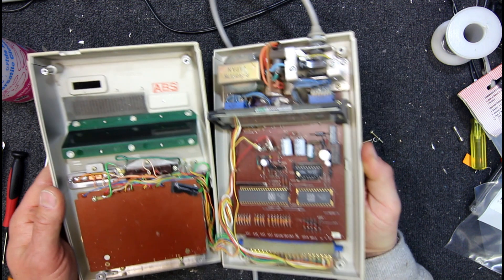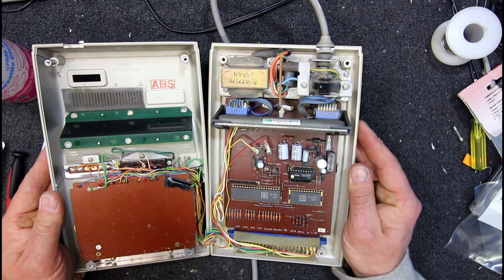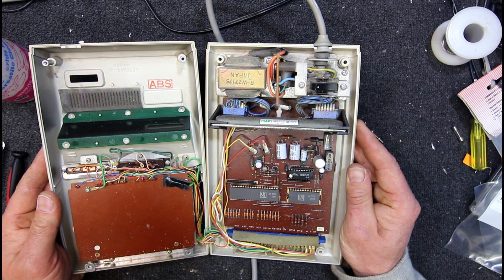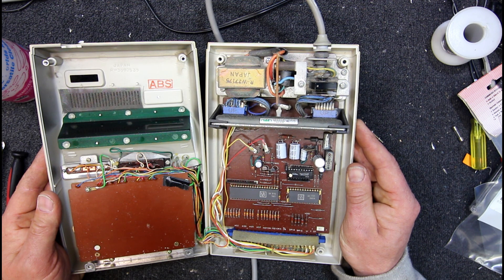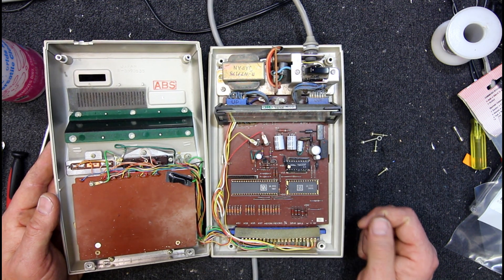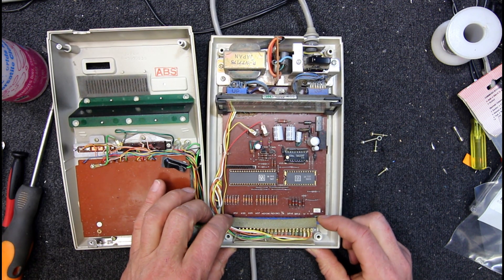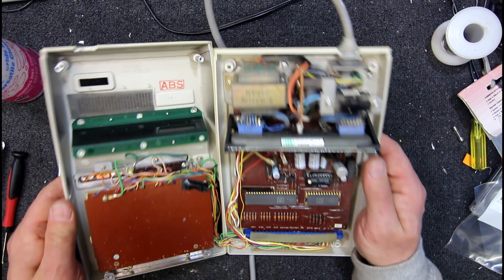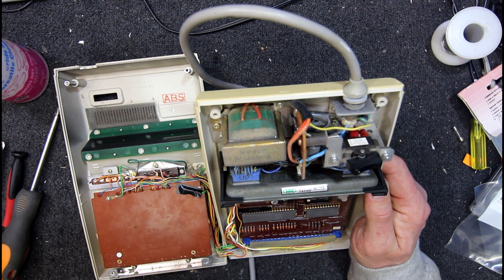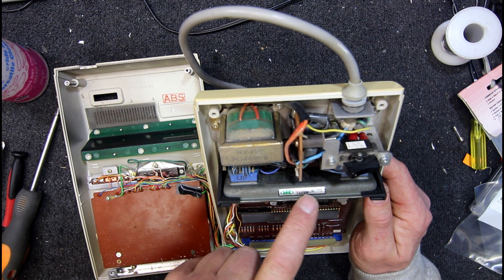A lot of dust in there. We've got the old, nice gold-plated chips — they're not quite ceramic ones. EA 7172, EA 7022, both have got 7401A. That might be the date code — 1974 first month, quite possible. It's even got an edge connector on it, on the board. Japanese ISE or something — DP127F. You could probably still find a datasheet on it.